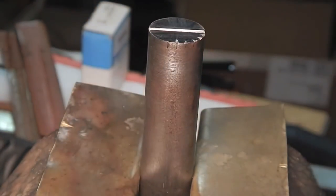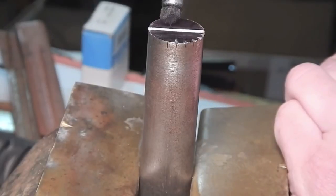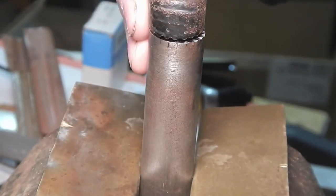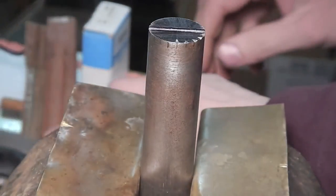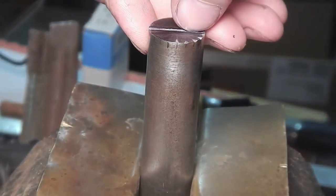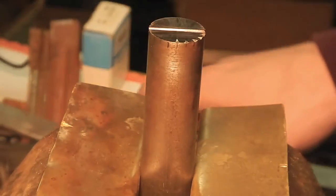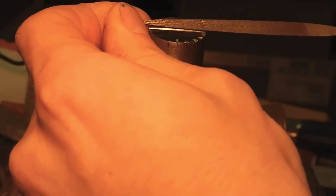So you've filed all the way across. After you've done this all the way around, you're going to take a marker, color it in, line up the piece as best you can, and then smack it with a hammer. What you're going to see is it's going to wear away the paint — you want this to dry first. Wherever the paint is worn away, that's where it's touching. You'll have to file it a little more this way or that way, or sometimes tilt the file a little bit more. You'll get down to finer and finer adjustments, and you can get smaller files to work your way in for fine tuning things that are just a little bit off.